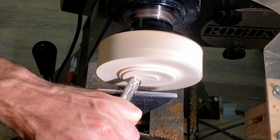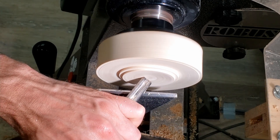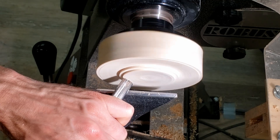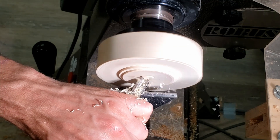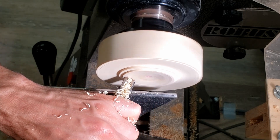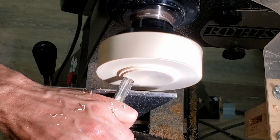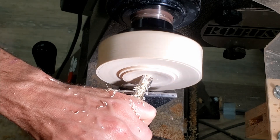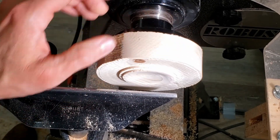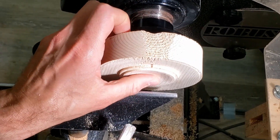There's one. Notice I have the tool rest adjusted so that the cutting point is right in the center of rotation. If I start getting the cut and keep it going — no cuts, then turn it in. Not bad. This is just two-by-four dimensional material mounted in a cross-grain orientation, and I'm getting a pretty smooth cut down here. Good job, bottom feeder. Now I'm going to show you how to do entry cuts to take off these two lips.